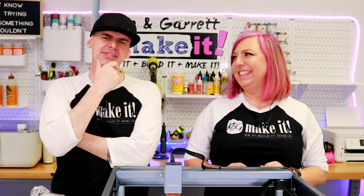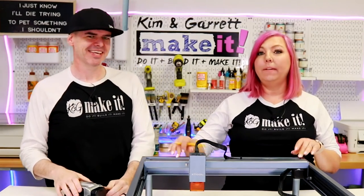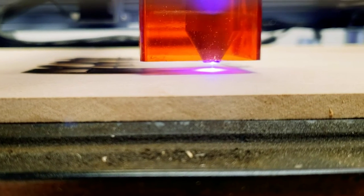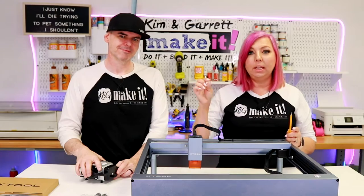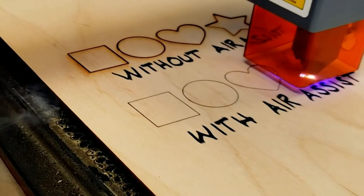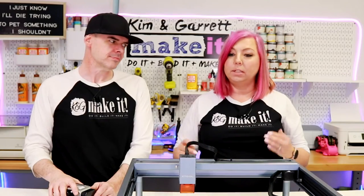And what are some of the benefits of using laser air assist? In the long run, it's more profitable because it makes your cutting faster and cleaner. It'll maximize the thickness of your materials. So we want to cut quarter inch MDF with this machine. We'll want that laser beam and that smoke efficient and clean so that it's maximum thickness. Again, cleaner finish. There's less char and less burn mark because the smoke isn't there. It's blowing that smoke away quickly, so it cuts through efficiently and cleanly.